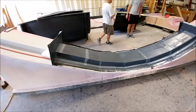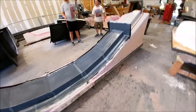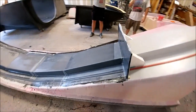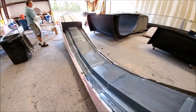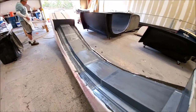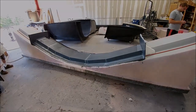By end of day today we had laid down the first layer of fiberglass and two lightweight layers of carbon fiber for the first pass on the main spar mold. Tomorrow I'll be laying the heavy layers on that, and then probably the following day start on the other ends to get that one finished off. That's our update for the first half of this week — thanks for watching.